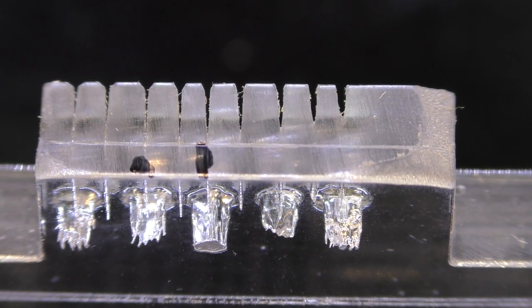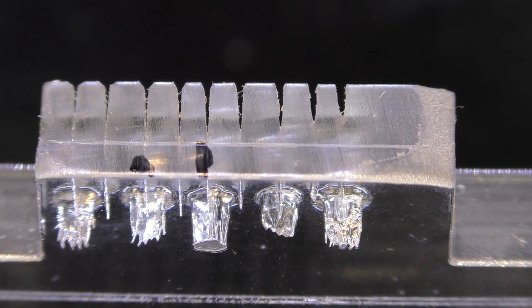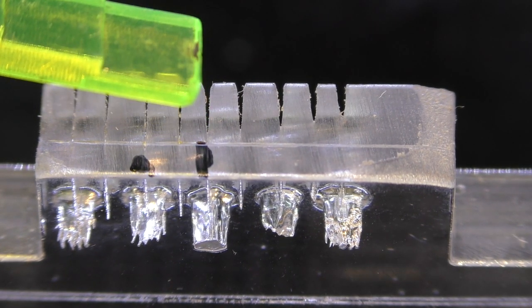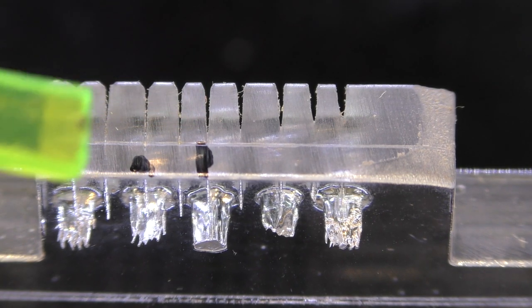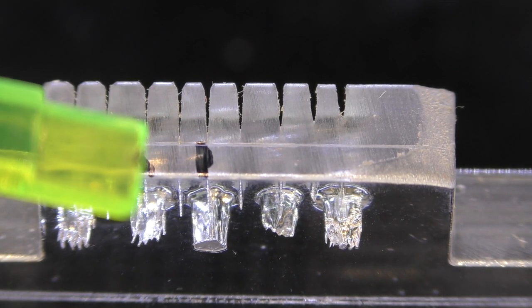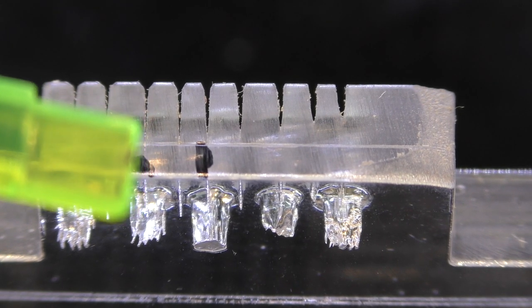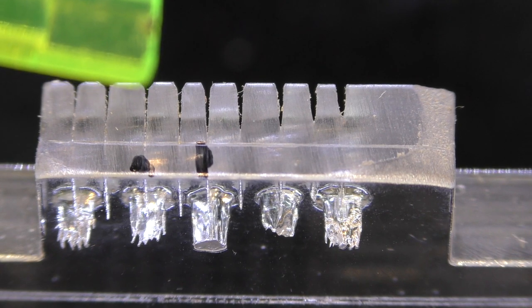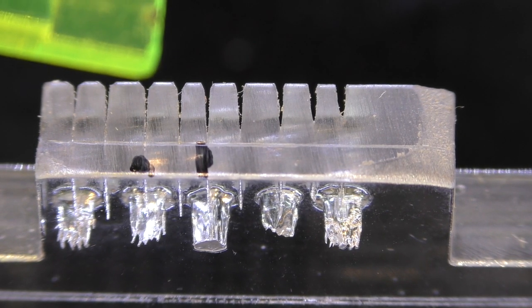Three things that we're interested in looking at for this test. First of all, where is the deepest cut? The third line in, which has got the dot underneath. That's why I put the 5 millimeter reference line there, because it makes it easier to pick up the deepest cut. That's the manufacturer's focal point just there. This is the intensity focal point where we got the deepest cut. And I'll talk about that deepest cut and why we got it in a minute, because it certainly doesn't look at the top here as though we should have the deepest cut.